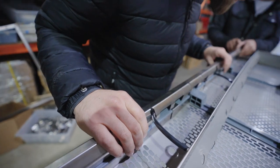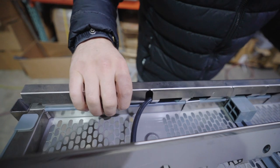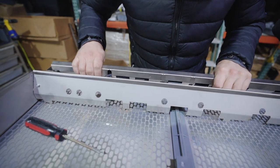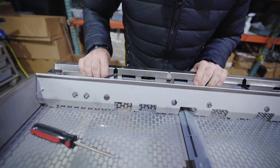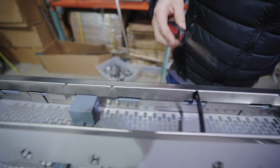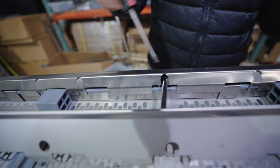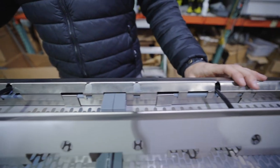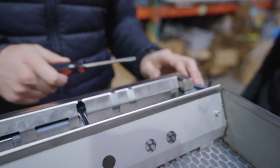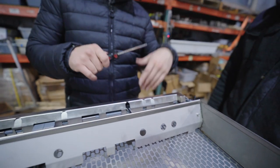Just take that out and make sure every piece is fitting properly first. All the waterline that was exposed before you put the other piece on is now all enclosed — there's no waterline showing and there's no space for the rats to pop in right there. Once you put the leg cover on, we'll move on to the next step.